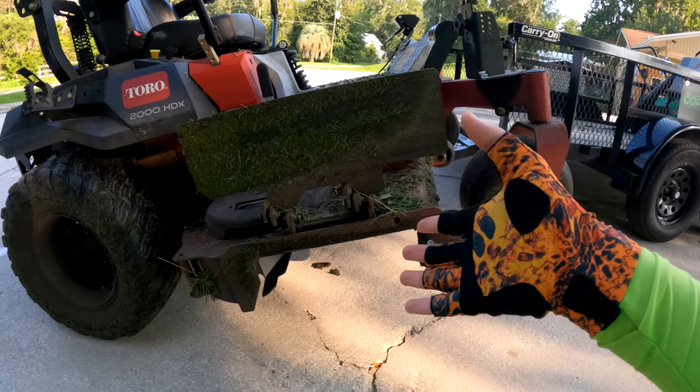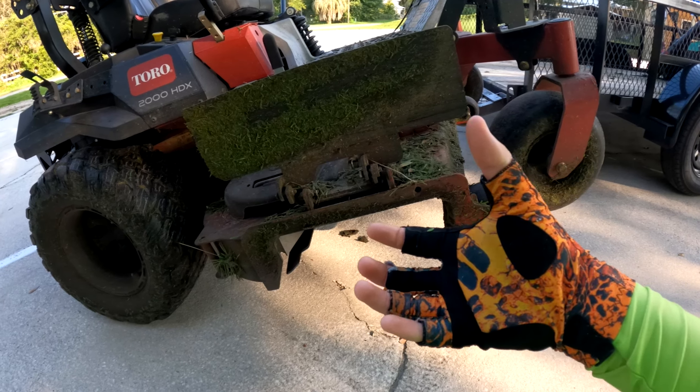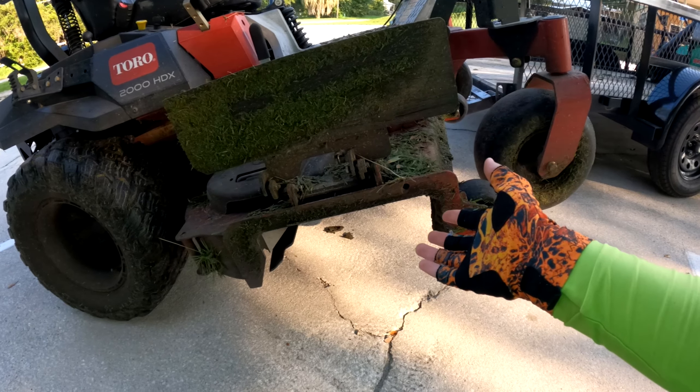One is it's absolutely enough of an issue that it will affect the suction or the lift of your deck. The other issue is the clippings that I've collected this morning can fall out this afternoon when I'm not even thinking about the wet grass anymore — and I've had them just completely splatter the side of houses.